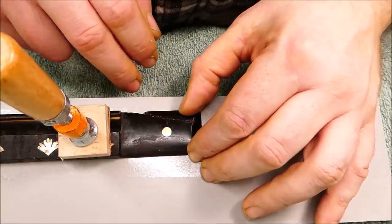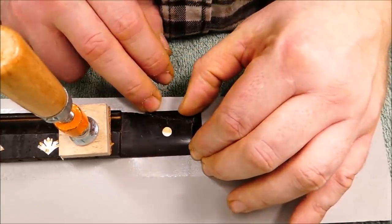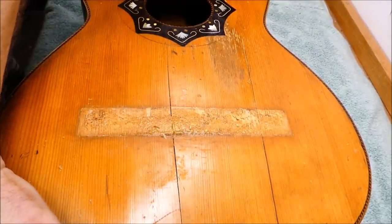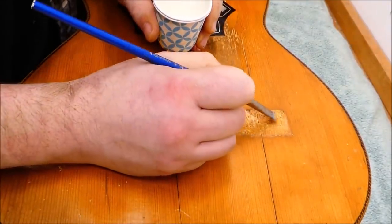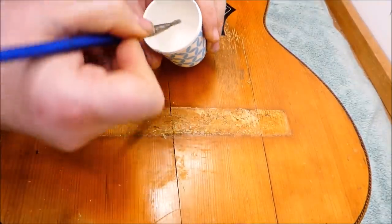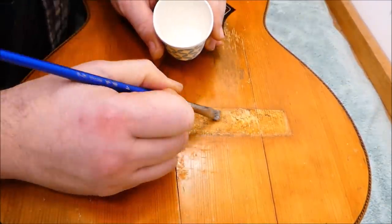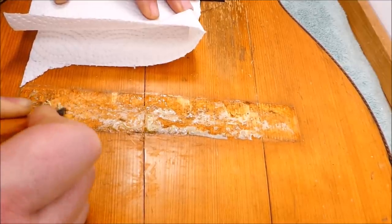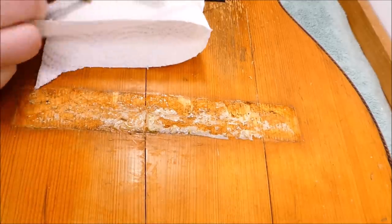This break had been glued previously, and I wouldn't trust any glue to do the job on these broken surfaces alone because they could be too contaminated. The super glue will hold it though. I'm going to try some of the De-Glue Goo on this adhesive to see what it does — this is basically a jellified kind of vinegar, acetic acid, which breaks down the polyvinyl glues really nicely. It'll also rehydrate hide glue. Seems to be breaking down that glue pretty well.